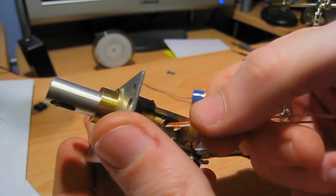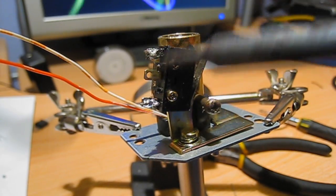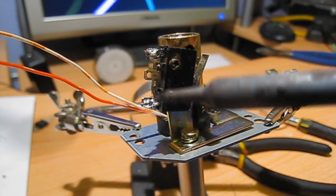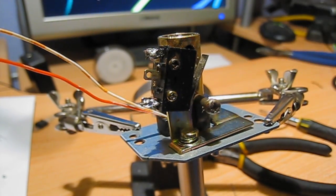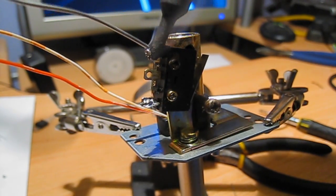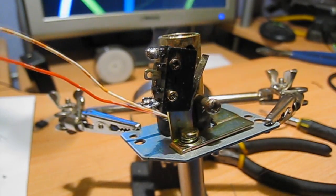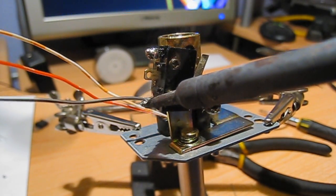There's no need to use glue or anything — just pushing that heat shrink tubing down inside there is enough to hold it in place. As you can see, it doesn't move when you pop it up and down, which is great. So once you've got your wires coming out, now you need to move on. You can see here you've got three tabs on your switch — your middle one's not used, so forget that one. The top one and the bottom one: you need to put a bit of fresh solder on here, because the solder that's on here is really manky and dirty by now. So put some fresh solder on there on both of them.